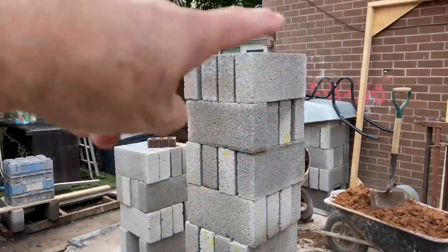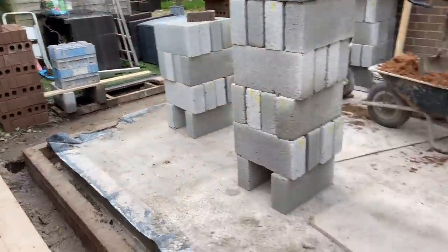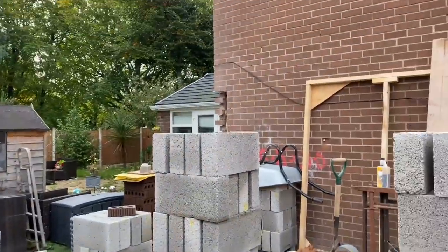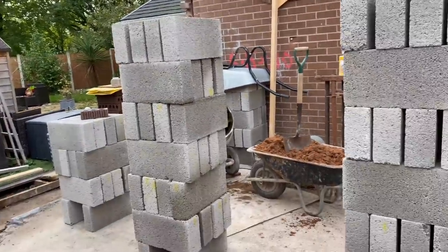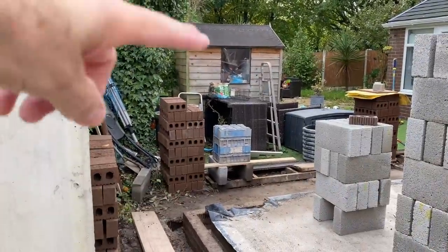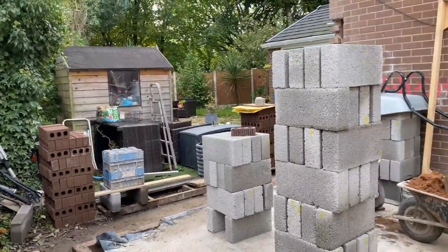Get a mix in and do a bit on this end. Just put a big return on this side. Pull it right down, because I'll have profiles each end. Profile, and then just corner block back to the door reveal there. So I'll measure that and then divide it by 28 and that'll be my gauge at this end. That's what we did on the last one. These beds are a bit up and down, but we'll get ours uniform, get them all the same.